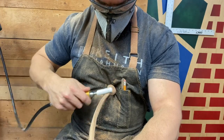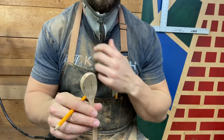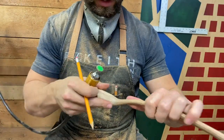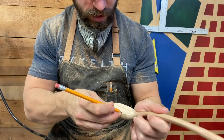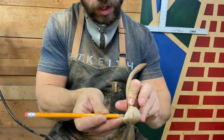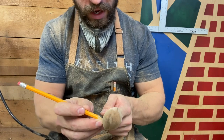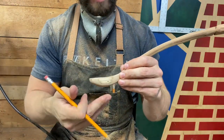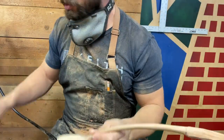I'm going to start cutting in the bowl now using this coarse cutting wheel — I can get in there and cut straight up, which is really nice. Then I'll come in with some other burrs and rework it, but I'm just going to give myself a very slight lip around this for right now, somewhere in the range of an eighth of an inch. That's going to allow me to know roughly where not to cut, and when I actually smooth the bowl out I can bring it right up to the lip. I don't have a depth guide — that's just going to be by look and feel — but I don't want to go much deeper than maybe a quarter inch from that lip.